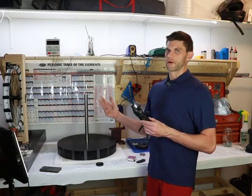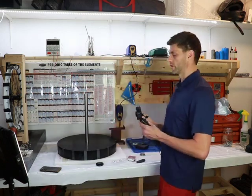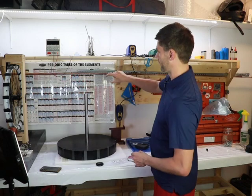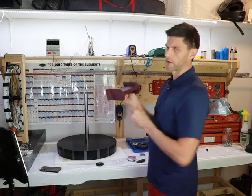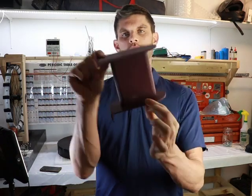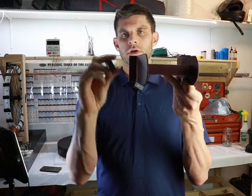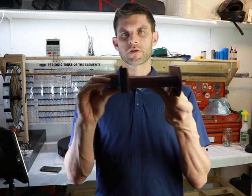The stator is going to be a housing built of three-quarter inch clear acrylic material — picking that up next week, which cost another $1,500. On the back of the enclosure there are slots that allow our coils to move in and out, so the face of the coil can be adjusted relative to the face of the magnet. The coils I've made are an oval shape — I made them longer just to match the length of the magnets, so the magnets will pass by the face of the coil.